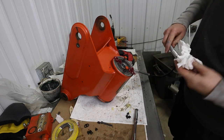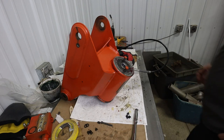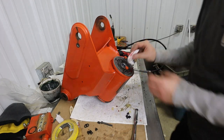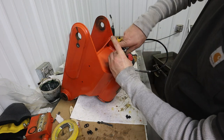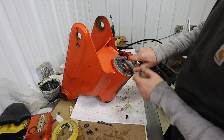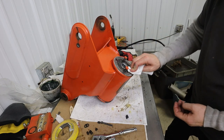She's full. I can see it coming out the sides. Lovely. The screws don't get too much. They get 25 foot-pounds, which is not too terrible much, so no problem here. And they also can't back out, because the flange goes over there. That side is done.